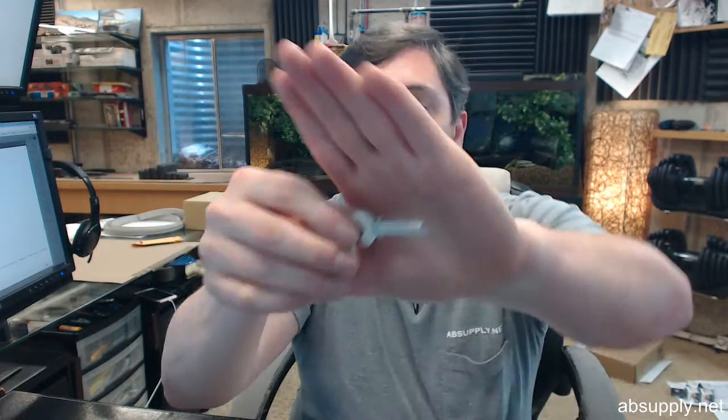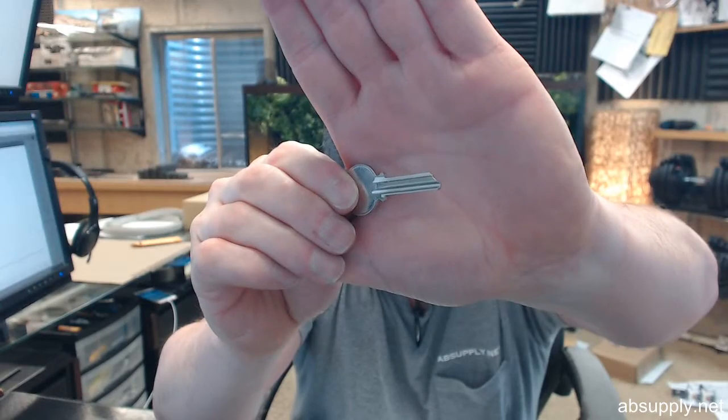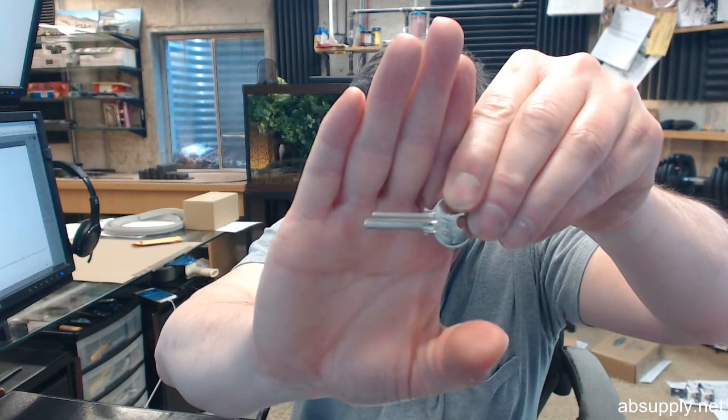There is an image below this video showing the broaching detail of the Keyblank, but what it's showing is as if you are looking down into the cylinder — not as if you're looking at the end of the Keyblank, but as if you were looking at the head down through it or into the cylinder. So if you're looking at it this way, be sure to understand you're looking at the symmetrically opposite view.